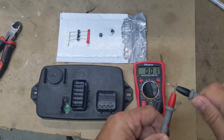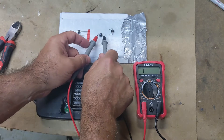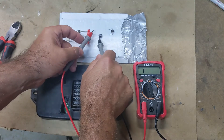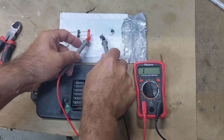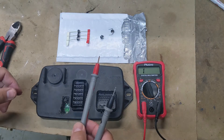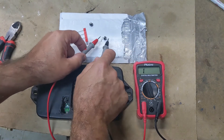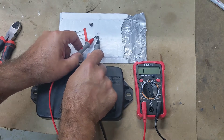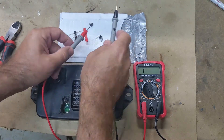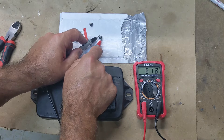If I short it out directly, I get that reading. Let's start with the old one — if I touch both conductors, I get a reading all the way through, and if I spin it around and touch both conductors, I also get a reading. That means it's conducting in both directions, which is wrong. Now with the new diode: nothing happens, meaning it's not conducting in that direction. If I flip the polarity of my tester and test it — notice I do get a reading. That's correct diode behavior.